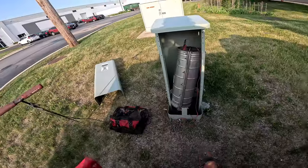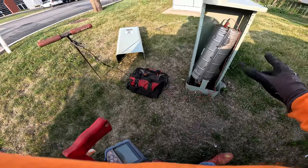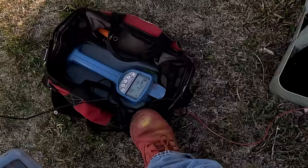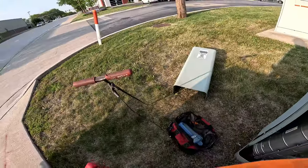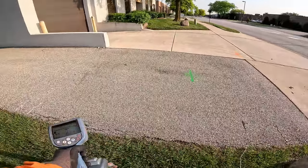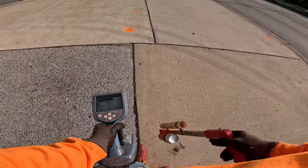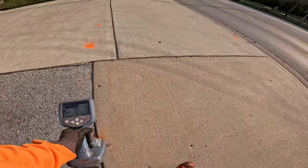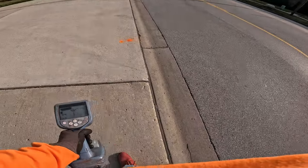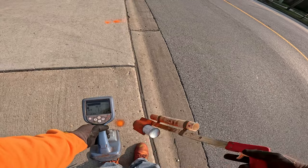When you're doing a splice case like this, direct connect to the top bolt — two cables — connect right there and good milliamps. Now I'm going to do my sweep. I've got a good tone right here, 5.6, and another tone right here, 2.7 — both tones good milliamps.